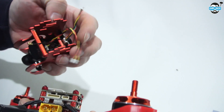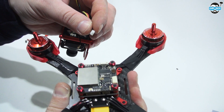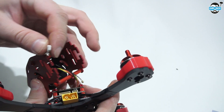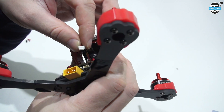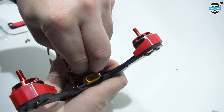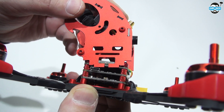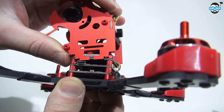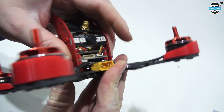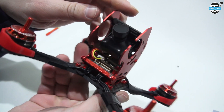If you have a micro receiver then it's probably worth trying to jam that up somewhere behind the camera. I'm using micro receivers that do actually fit inside this, which is quite nice. The camera then plugs into the very front of the OSD VTX board. Looking at the rear of the stack, we can plug in the LED buzzer board into the right plug on the rear. Then finally push the pigtail down onto the VTX. Note that the side plates will foul on the USB, so you'll need to back off the screws on the standoff so it widens out slightly and goes around it. Even though I was taking care, I did bend the USB slightly, but there is enough room to get a USB cable inside now.